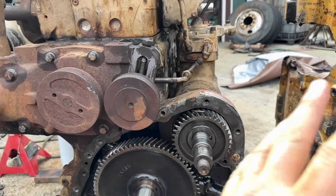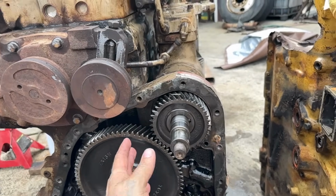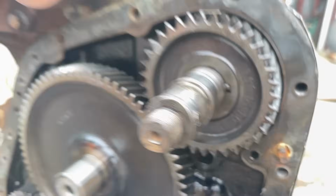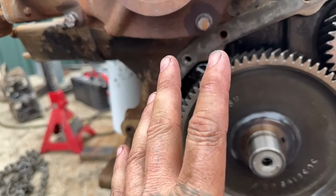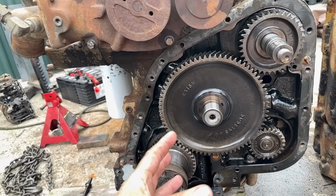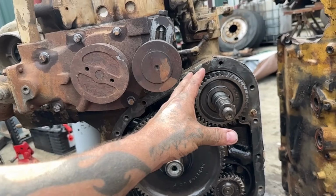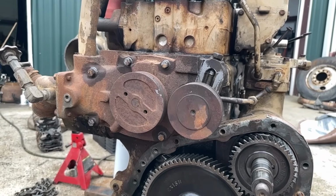And I'll get the accessory drive out of that motor and put it in this motor. And while I have that off, I'll pop off the rockers, the cam covers down there, and they're right there. We'll take those off. Now those are shimmed for proper spacing. We're just going to leave the shims on it that are on it. Hopefully not destroy the gaskets. We'll pull this camshaft out, slap the new camshaft in on the timing mark, put the accessory drive in, put the rocker followers on. Hopefully we don't kill the gaskets.